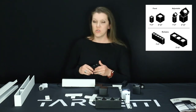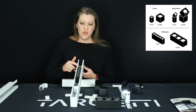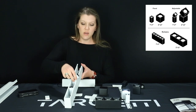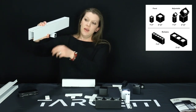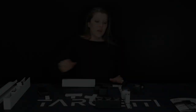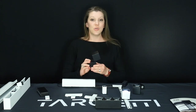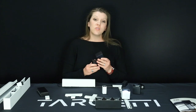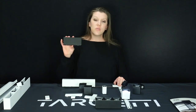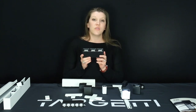These are great complementary pieces to create beautiful ambient light fixed module looks. When mounting them into your profiles, note that the fixed module sits flush to the bottom of your profile, where the adjustable will protrude down outside of your profile to create the 90 degrees of adjustment needed as well as allow for rotation. The fixed 1 inch by 1 inch is available in 4 watts, while the adjustable and fixed 2 inch by 2 inch is available in 8 watts for spot and 10 watts for flood and medium wide flood. The modules are available as 9 watts for the 5x small and 21 watts for the spot and 24 watts for the flood and medium wide flood in the large.